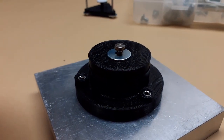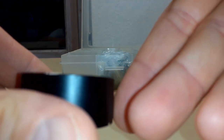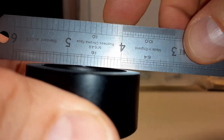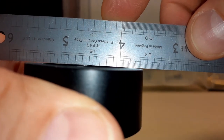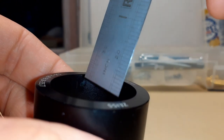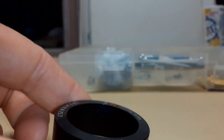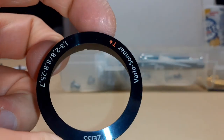What happened is that the dent here, which used to go from outside to inside, now goes to the outside. The metal is simply deformed in this region, but instead of pushing down onto the outer shutter it's now warping outward, hopefully not causing any trouble anymore. The next step is to glue it back in place on the camera.